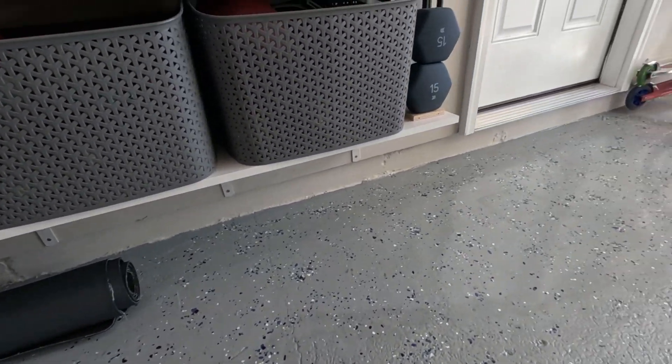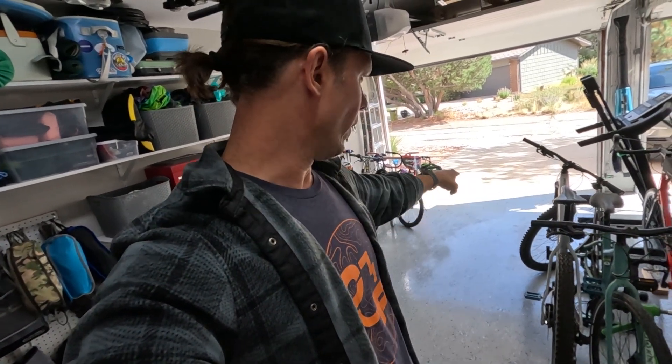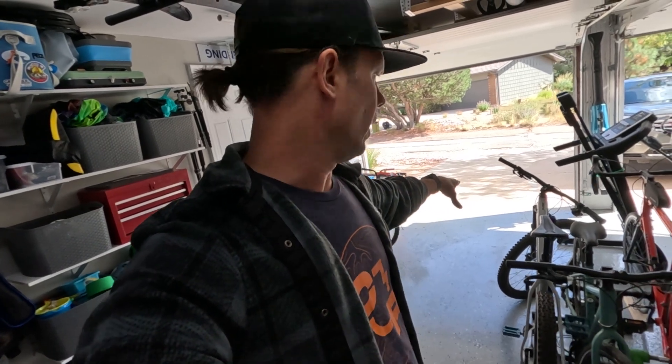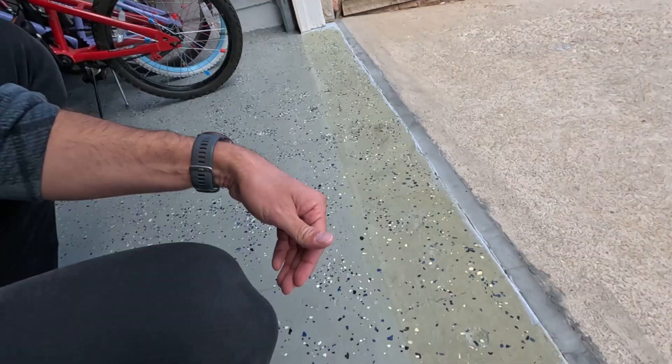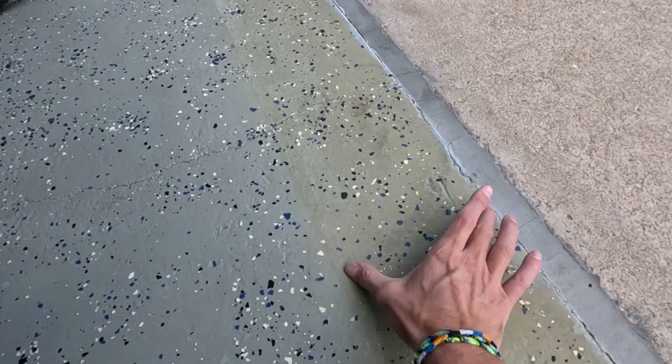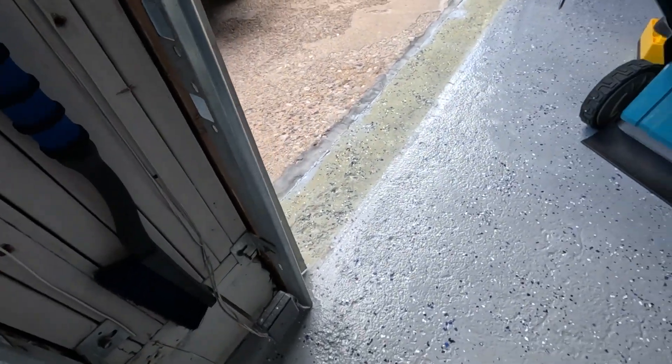The biggest thing I learned was that the clear coat was right — with the sand mixed in, it makes it slip-resistant, which is great for rain and snow here in Colorado. But one thing I learned is that the clear coat and the sun do not get along. About six inches outside the garage doors, when the garage door is shut, it exposes that little strip to the sun. Let me show you — right here, about six inches, it just turned a little yellow. So that's something to note.